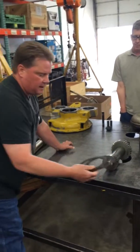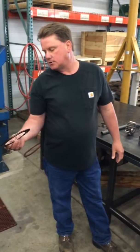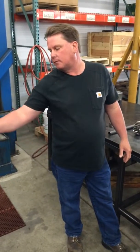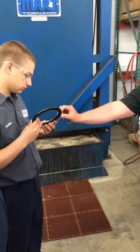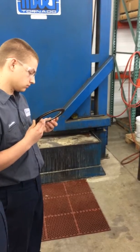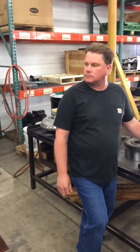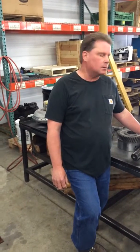These are some examples out of Paul's collection. These are a couple of funk clutch plates, and the teeth give you a good idea of what happens, how they wear. So even though the friction material might still be thick enough and in good enough condition, the teeth are wearing to the point where at some point they're going to rip right out.